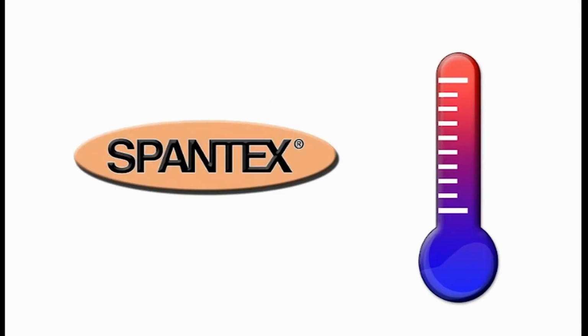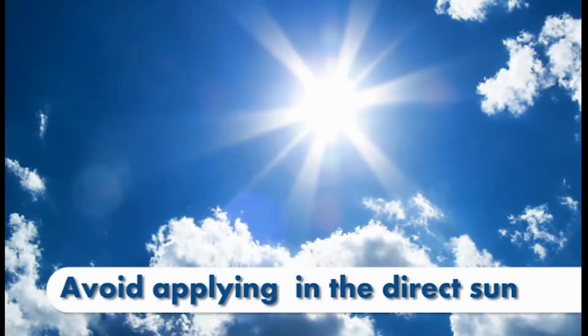When looking for the perfect day to do your project, we recommend taking precaution with extremely warm or cold weather. The perfect temperature is between 50 and 77 degrees. Direct sun or extreme heat on the deck will cause the product to dry too quickly, which will make it difficult to spread. If heat is in question, always test the deck surface with your hand.